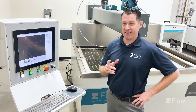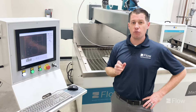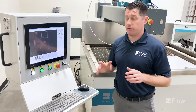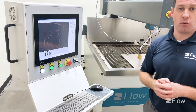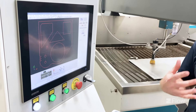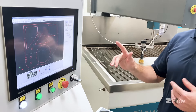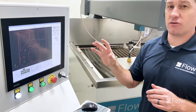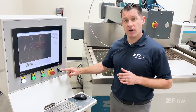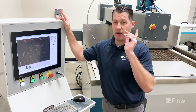We're going to do abrasive cutting on the Mach 100. We've got some quarter inch aluminum set up on the table. Before we did that cutting, I wanted to walk everybody through the operator interface. What you have on the screen is a full touchscreen display using FlowCut — that's the CAM portion of our software. Your operator simply inputs the thickness and selects the material type to be cut. The machine controls do all the adjustments so you can cut it properly, and you can make changes live on the screen without going back to your programming station. There's also a full USB drive port and full network connectivity so you can transfer files in and out of an office.